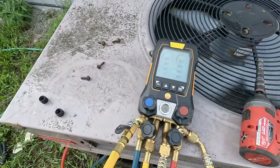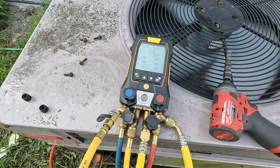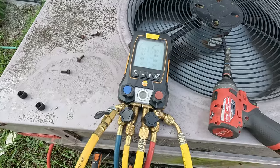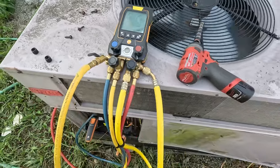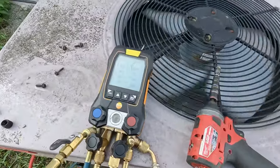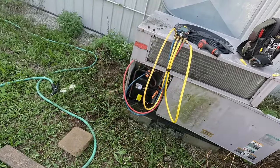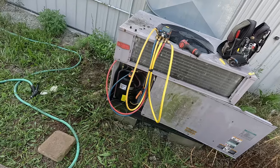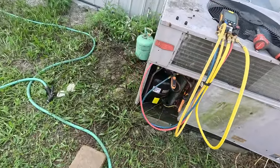Yep, down to 2 degrees superheat. What it was — they probably did that to push the suction temperature up, the saturated suction temperature, above freezing. Would not surprise me, but it's overcharged. Now we're up to 30, and don't forget the condenser coil is still wet — it's going to change even more as it runs. Also it's a so-called commercial application, but there's no fan cycle switch on it either.